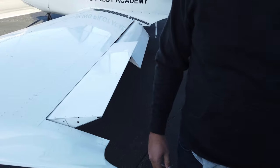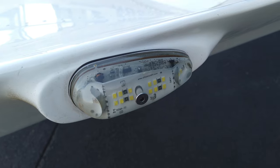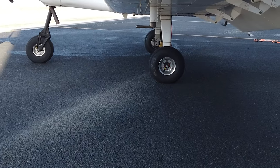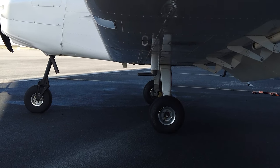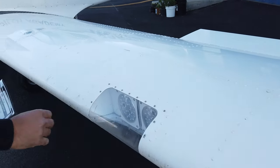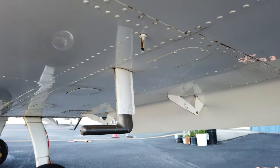Moving around the wing, check for any damage to the wing tip and check the condition of the lights. If doing a night flight we would check the navigation lights powered on. Squat down to take a look at the tire and the pitot tube from underneath the wing. The shape of the tire as seen from the side is a very good indication of inflation — all three tires look properly inflated. As we work around the front side of the wing we have the light lens; look for any damage or signs of an issue.